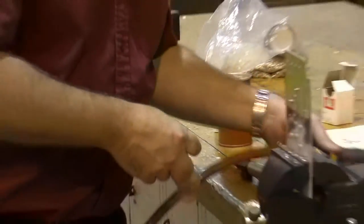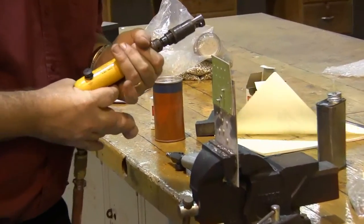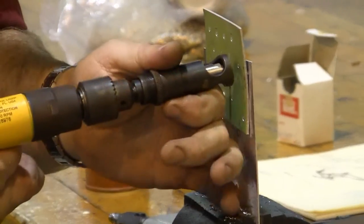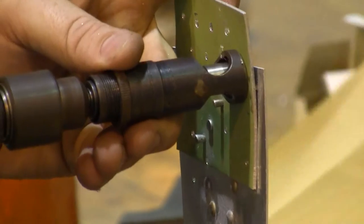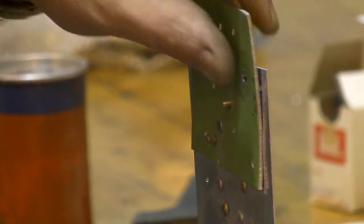I'm going to have to make sure that they're the proper depth. So they get chucked onto my drill, and then I hang onto them by hand, and I feed that into the countersink hole, and I work it in until it won't countersink anymore.